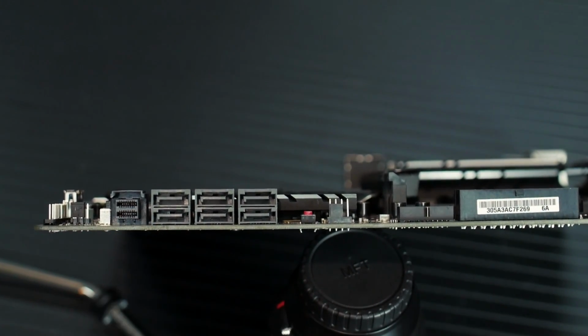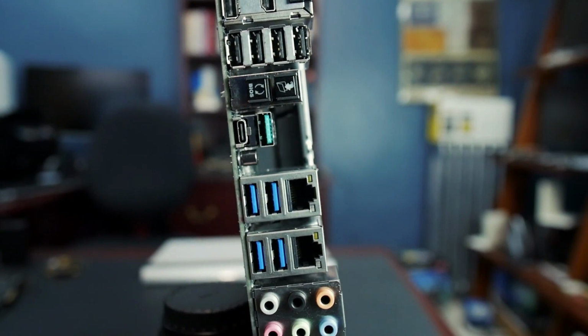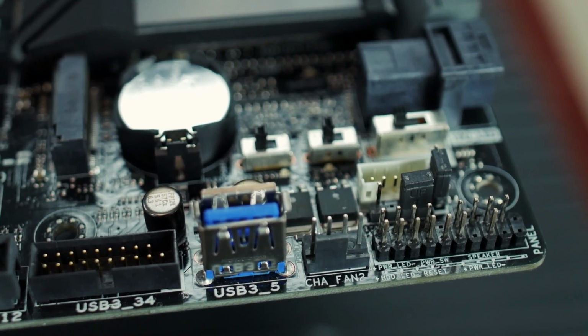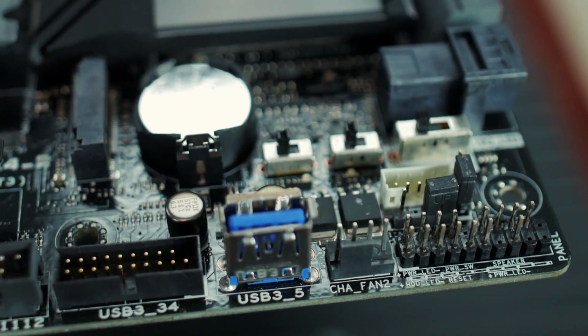Now the Intel Z170 chipset provides 6 USB 3.0 connections. And what they've done with that is also interesting. There are 4 USB 3.0 ports at the back. Those are connected through an ASMedia USB 3 hub to one of the 6 ports on the Intel chipset. 4 of the 6 ports go to the front panel USB 3 connectors, and the other one is available in a vertical connector at the midboard. So that USB connector is wired directly into the Intel chipset.